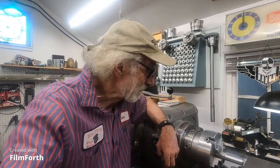When something starts chattering, you can back it off or even speed it up — you can play around with that a little bit. The Hardinge has the variable feed and that worked in a good way too. So you get an old geared-head machine like this, everything's kind of fixed. I've got to get the tool just right and fit it into a slot that the machine operates at well.